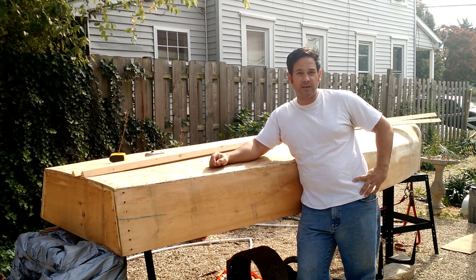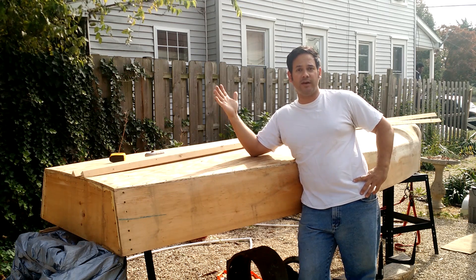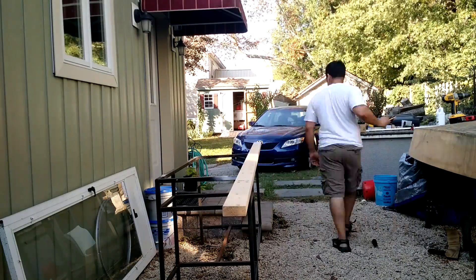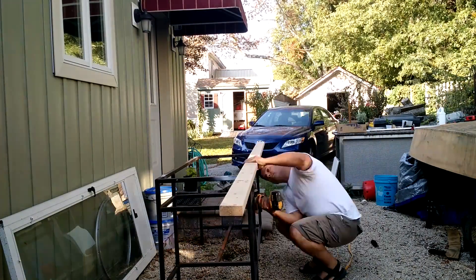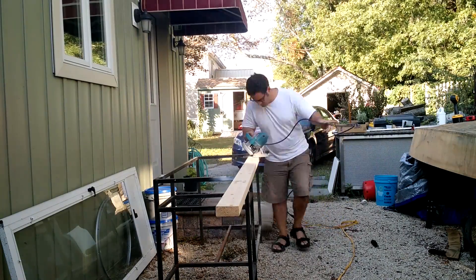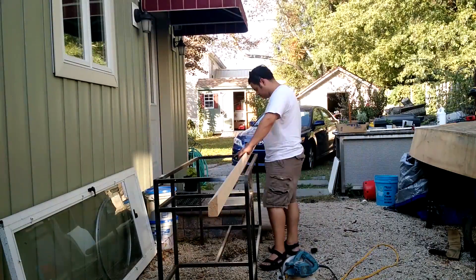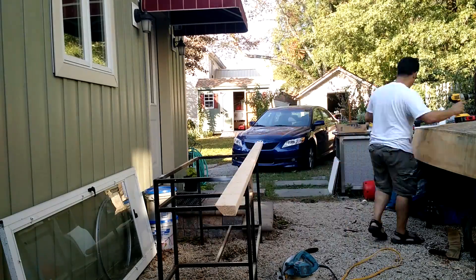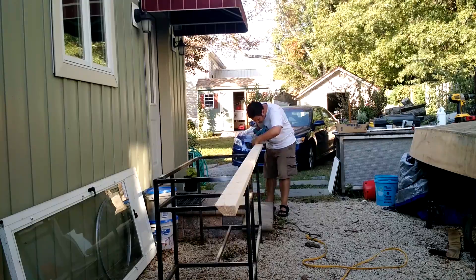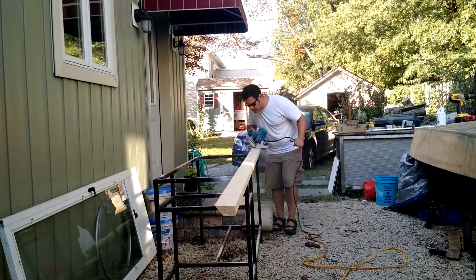I've got to snap a chalk line down the center of the boat and get my measurements so these are even. I'm very lucky that I had an old drafting table stand that I could use as a bench. The first thing I had to do was drill a couple of holes in order to support my 2x4, because I do not have a table saw. I do have a circular saw and I was able to just rip down two pieces at 45 degrees. I'm going to use these 45-degree pieces as the strakes, with the hypotenuse of that triangular shape against the hull of the boat.